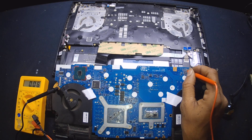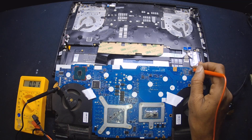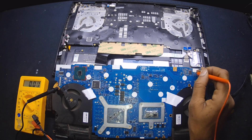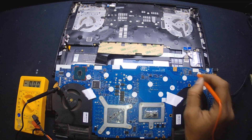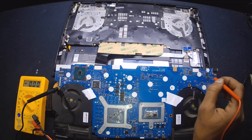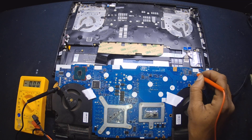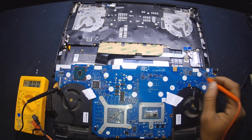Normally if there is a problem I'll be able to see any missing volts around the IC. I'm checking each side of the IC — at the moment I'm not worrying about where it is getting voltage for powering up and releasing voltage for another section, but I'm just checking what is going in and what is going out. If it checks out, I just move on to another section.